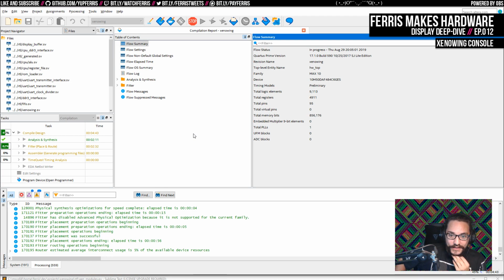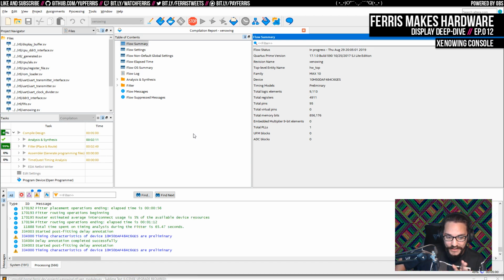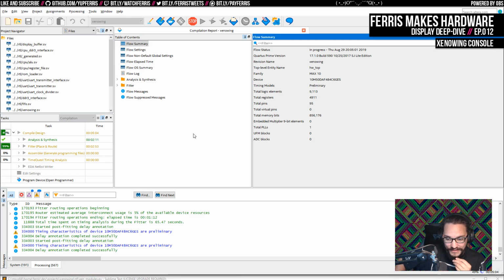So the GPU, I want it to be a basic rasterizer. The first thing I actually want to do with it is clear the screen. I don't think I'll expand on any blitter-like functionality beyond that. So clear the screen is probably the first thing I'll make it do. And I wanted to do a triangle rasterizer. And first I'm just going to do flat shading and no texturing. So it'll just plot whole colors.